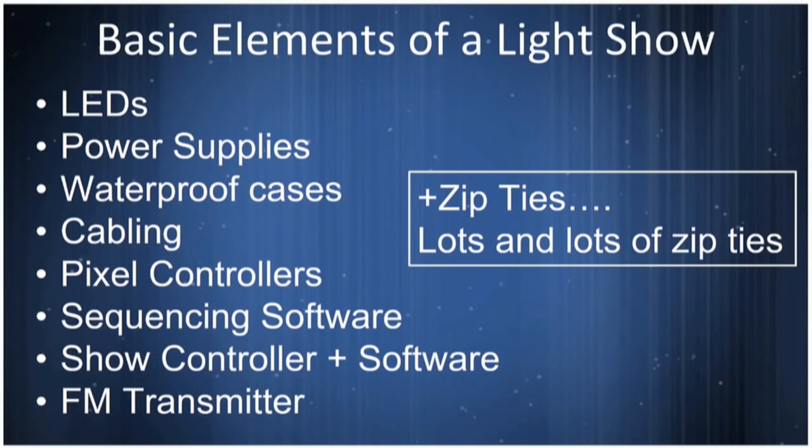The basic elements, if you're going to build one of these: you certainly have to have LEDs — lots and lots of LEDs. Power supplies are a challenge, not because of huge amounts of power, but they've got to be outside in the weather. Where I live in the northeast, it can be 80 degrees or 5 degrees, and there's always precipitation. So the things you put out have to consider the elements. People do things as simple as tackle boxes, adapting Pelican cases, or junction boxes meant for telephone and cable that mount to your house. The white box here is a pixel controller — it takes network commands and converts them to the protocols needed to drive the lights.